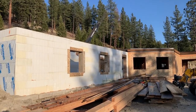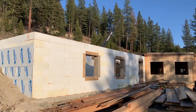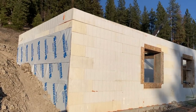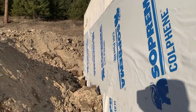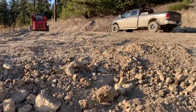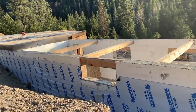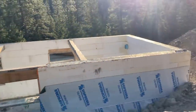It's a very nice day. I've got Tyler and Isaac helping me today. We're going to put the board and batten on the front side of the greenhouse — that's the ICF foam blocks for the concrete. We're going to put some vertical one-inch roughs and board and batten on top. I backfilled the back part yesterday — had a big pile of dirt there and moved it along the back. There's still some backfill needed, but you can't backfill until you have a floor on it. Next week a concrete cap goes on and then I can backfill.